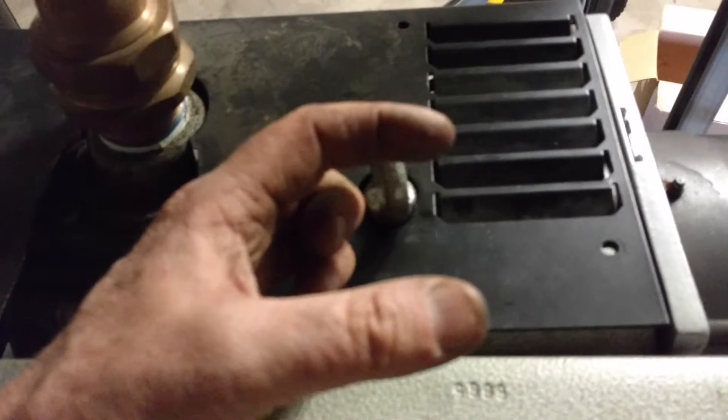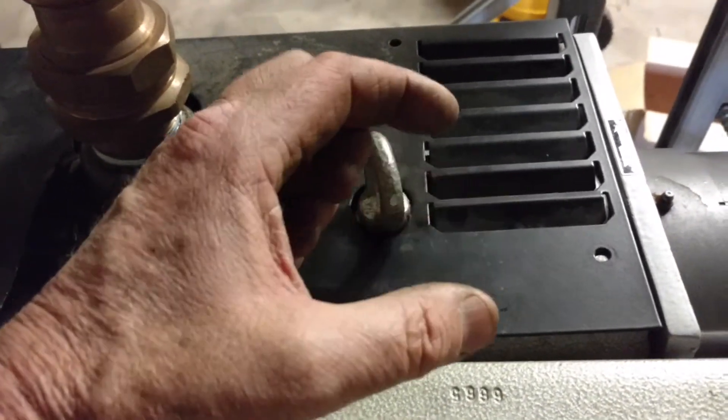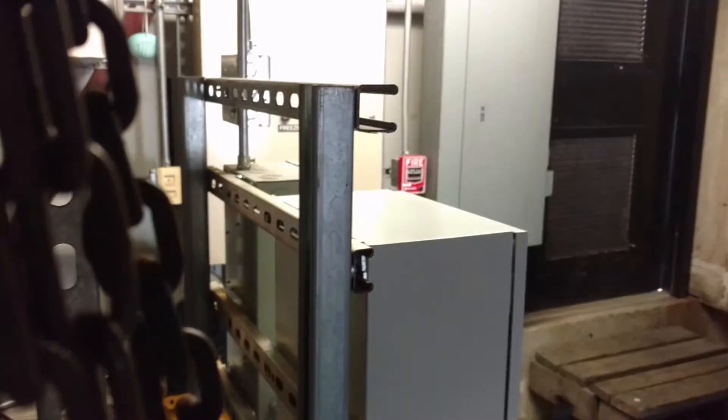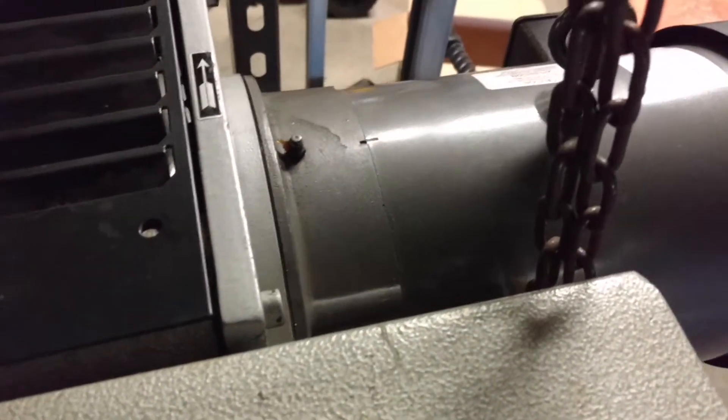Like these teeth on both sides with a rubber insert. But that coupling kept cracking because when the starter kicked on, it was like full force voltage — all 480 volts at once. And over the course of a year or so, I kept cracking the coupling.